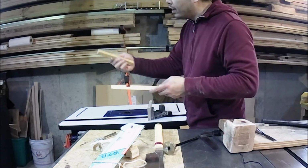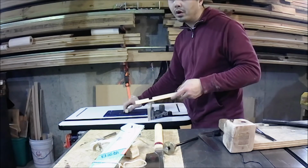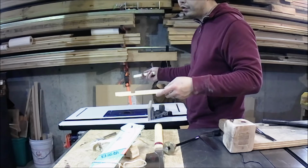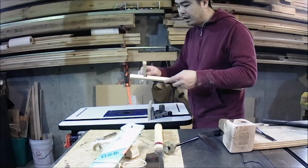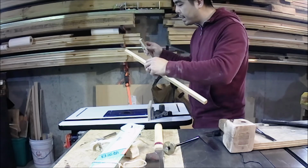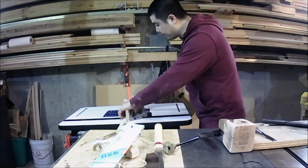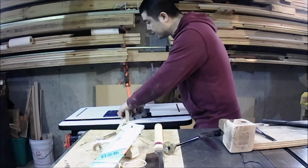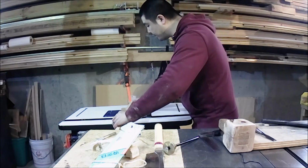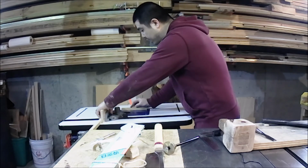I don't have a ruler. Imagine this is 1/2 inch. I would get a 1/2 inch bit, or actually smaller than 1/2 inch, maybe 3/8 of an inch, and take one pass so that I know this is smaller than this. The second pass, just slowly ease up to it, slowly finding it. Once you measure it perfectly, put a stop block here, so that the next time we repeat that cut, you put it right against it, go right up to it.